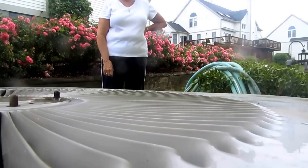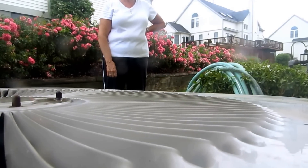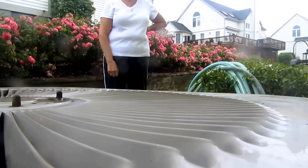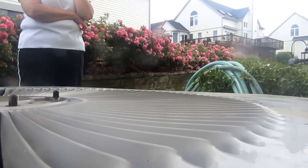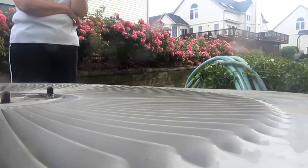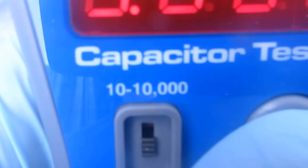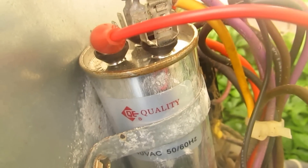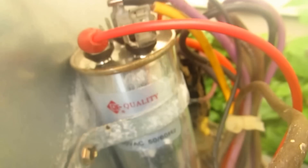Let's see what was right here. Which one is the fan? Brown — you flick on it, the capacitor's bad. The fan side of the capacitor is bad.